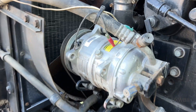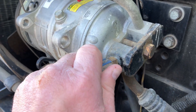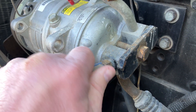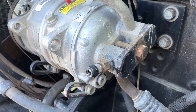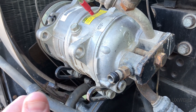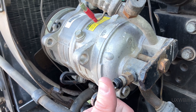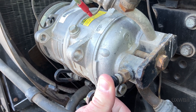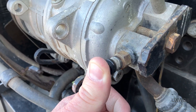But I know we do have one thing already that needs attention, and that's this Schrader valve right here — listen very carefully. This is definitely leaking. Now you have to be very careful doing this because your skin is porous and you can pump yourself up with an unwanted fluid or gas very quickly. If I put my thumb there for a few moments I can feel the pressure building.